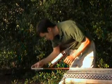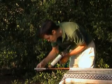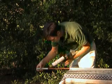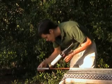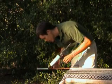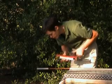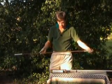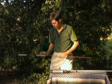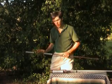This is polyurethane roofing sealant. It's kind of hard to work with — very stubborn to get out of the tube and it sticks to everything. If you get it on your hand it's going to be really hard to get it off. But once it sticks on something it really goes on well. As you put the conduit down over the rebar just twist a little bit so it gets firmly around there, then get it to where you want it to be and leave it. You only have to glue the bottom end because that'll be enough to hold the whole thing firmly. Slide another piece on down, decide where you want it, put another pile of glue, twist it down about an inch over the glue, and leave a good pile on the bottom so it won't move. Then let it set up overnight.